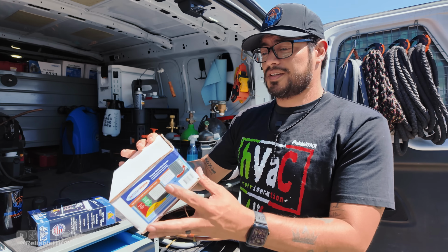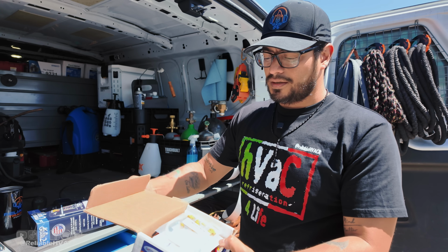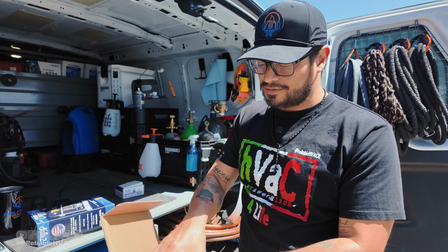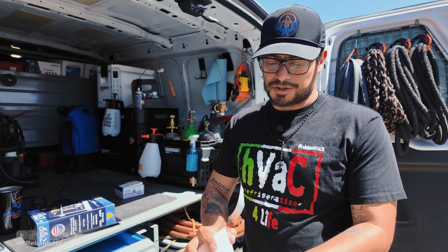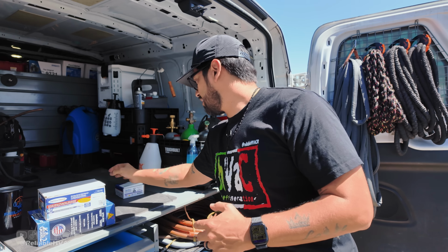They also have a soft start. So this is from Diversitech, but it's Soft Start Home by Soft Start USA. So Diversitech has a lot of different, they got all the connectors and everything in the box, but they have a lot of different products that you guys can get. So obviously check with your compressor manufacturer literature, all that, if you're okay to run a soft start. Usually you just have to double check. They will let you know that their compressor or that one that you're looking to put this on is compatible or recommended, right? Because there's some that they tell you no. So make sure you do your homework, your research, and you can put a soft start from Diversitech there.